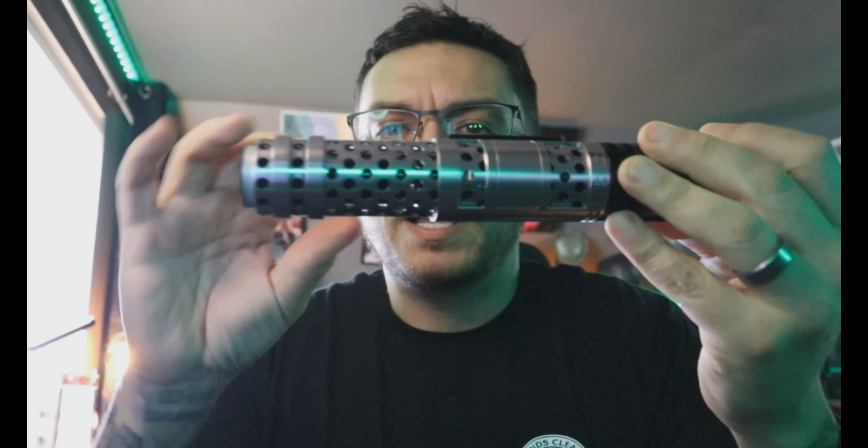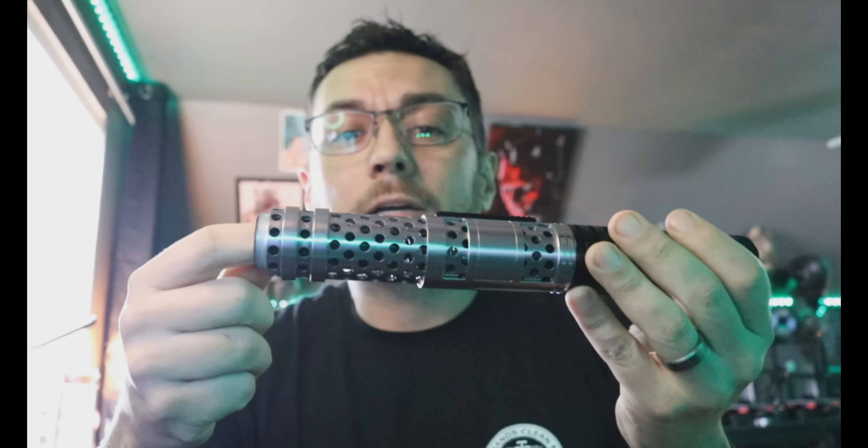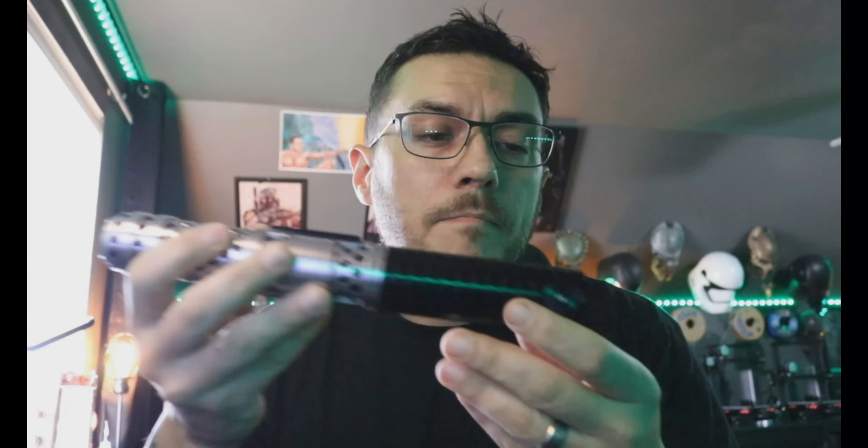When I took this saber completely apart, there are two places for shine-through. You've got this middle section on both sides of the switch assembly, and then you've got this upper section. It's not going to show up very well on camera — you can't hardly see it through the mesh. What it looked like was in the black core, there were random holes drilled into it for shine-through, and that caused a lot of damage. I cleaned that up as best I could with a file.